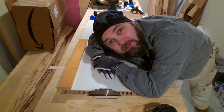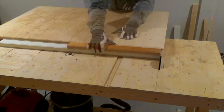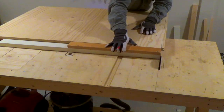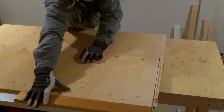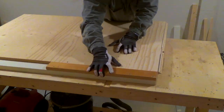So, now we need to see it in action. I get my 8x4 panels cut down in 3 pieces at the local timber merchant. So they are more or less 80 by 120 centimeters when I get them into my workshop. And my initial cuts here are just taking off the lips on both sides of the panel.